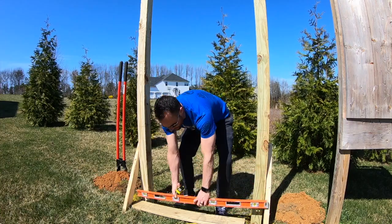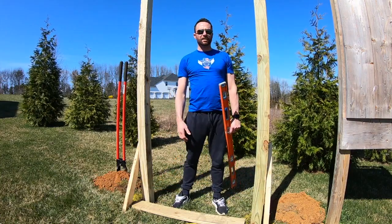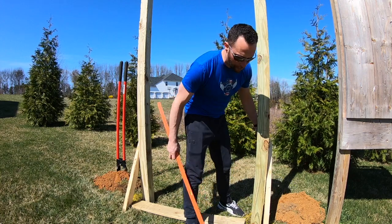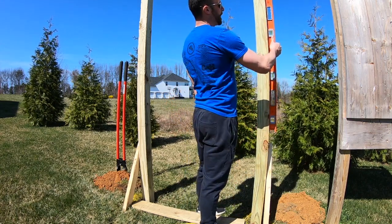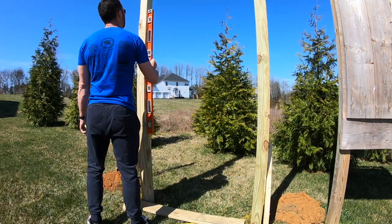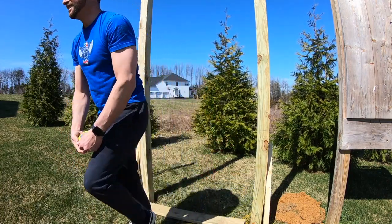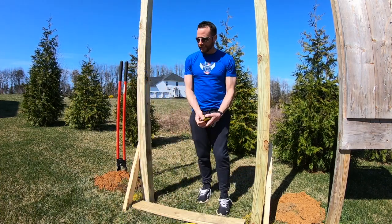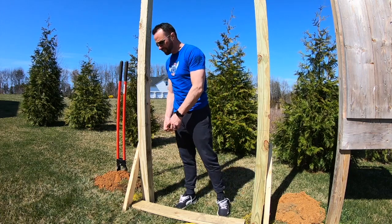Once the footer mark is set, we bring the level up and level that board, then assemble the rest of the target. But first we have to sink these posts in concrete. The most important thing is making sure you have a nice square target setup — that's hard when you're out in the middle of nowhere with nothing to pull a square line off of. Take a two-by-four or any spare piece of wood, put a point on the bottom, set it in the ground as a brace, check both sides, and make sure you're level. We have 50-pound bags of quick-set concrete — we'll use about one and a half bags total for both posts. Pour all the way down but only come up to about four or five inches below the surface so you can put dirt back on top and grow grass later.